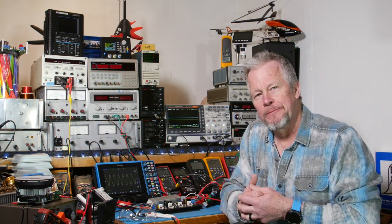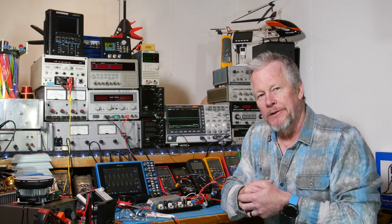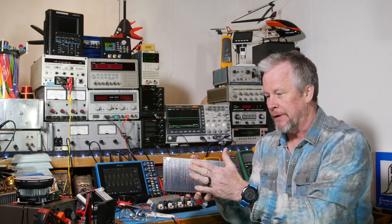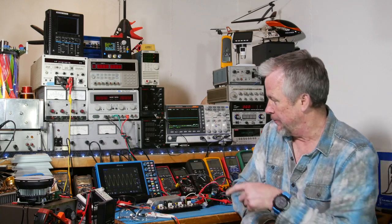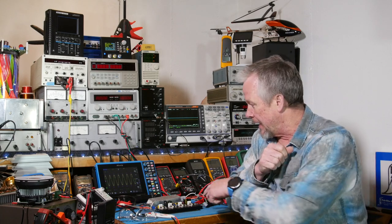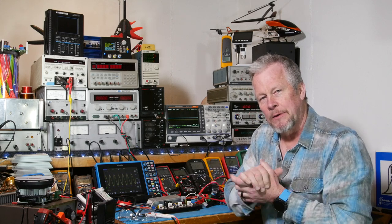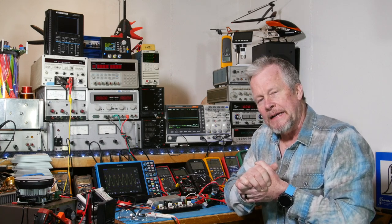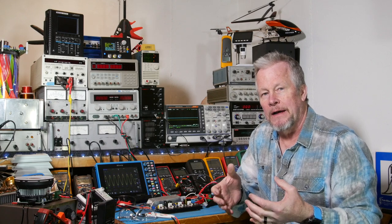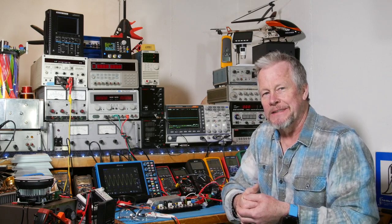So what do you think — that doesn't look too bad! For the next video, I want to mount this on the heat sink that goes on the side of the box. Each board will be mounted to one side so we can see how temperature stabilizes. Then we'll set the bias current — I've almost got the schematic done, so I'll get that and explain how we set up bias for the Class A. The bias setting determines efficiency and how much power we're dissipating at idle. At low output power like 1 watt, efficiency is pretty terrible.